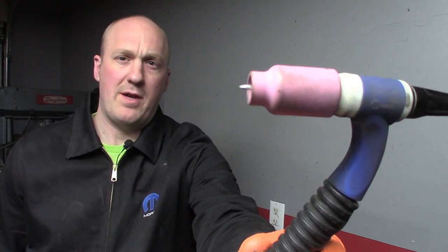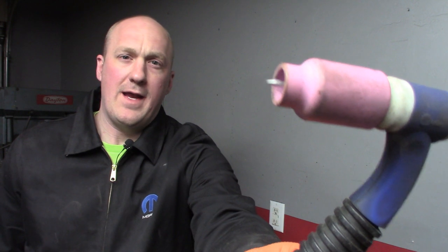A really important factor when you're doing TIG welding is the tungsten rod — that's the little metal rod inside the torch. When you're welding mild steel or stainless steel, it is extremely important to keep the tip of that rod very sharp, because that's what helps focus the arc. If it becomes dulled or rounded in any way, the arc will start to distort and widen out, heating a wider portion of the metal and making the weld puddle distorted, spread out, and not very clean.